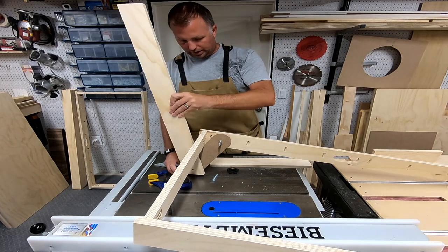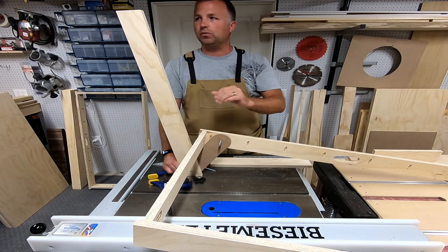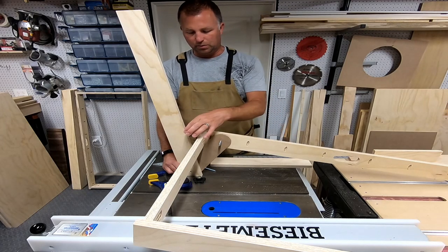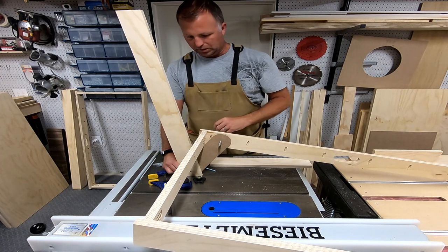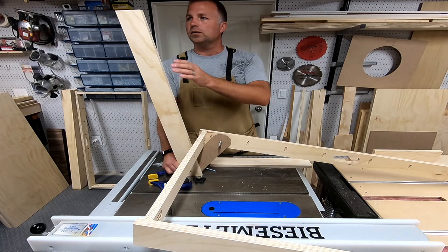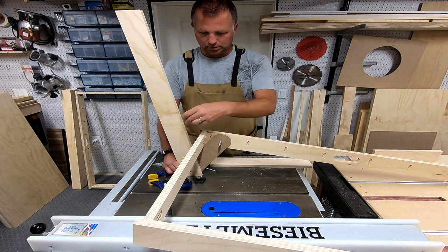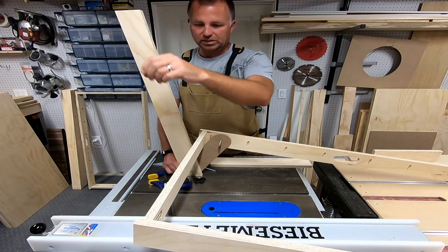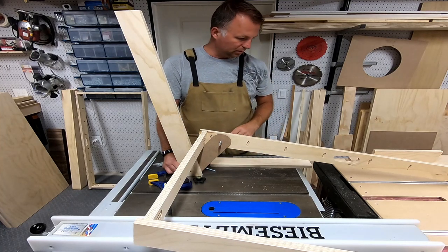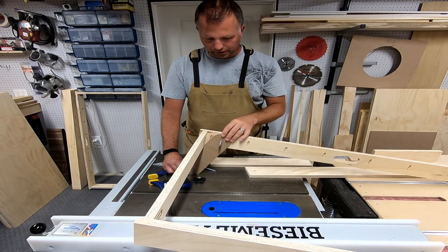That finishes the leg section. The next piece — which took some working out — is the cup holder arm. It connects to the bottom of the leg with a nut and wing nut. The idea is to get it out of the way so that if a bag comes up short it can fall over, indicating it's off the board. It ends up being about 10 degrees angle. When this folds up, it also folds inside the box just like the leg. I still need to build support pieces to go across and a top piece with the cup holder holes, plus one support piece on the leg for stability. I'll head to the router and show you how we cut the legs.